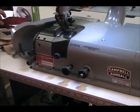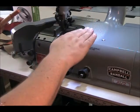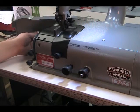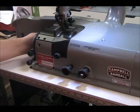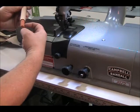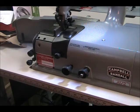And to deburr the edge, because it's going to roll over a rough burr as it sharpens, I'm going to use this tool, and to do that, I'm going to reach in and watch where I put this. I'm going to bump it up just at the inside of the knife so that it rubs not on the point. I'm not hitting the point. I'm hitting right here on the edge and just cleaning the inside of the burr. So let's go ahead and crank it up.